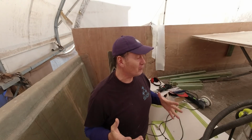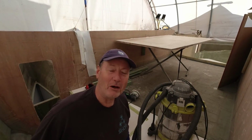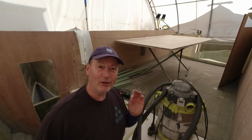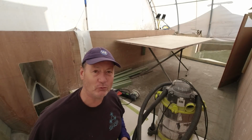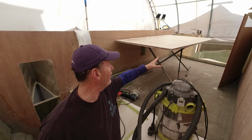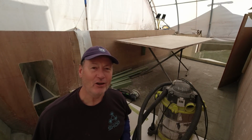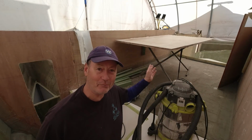It only weighs around about a ton, maybe 1.1 tons. It's not ridiculously heavy, but it still needs to be done. Also, the main central bulkhead, this big guy here. Now I've lost the footage of me laminating that. That's a layer of 600 double bias on each side of 25 mil Australian hardwood marine ply. That is possibly the best wood I can buy. That's a $500 sheet of top end marine ply. It is totally void free, and how I know that is I've already cut the bulkhead out.